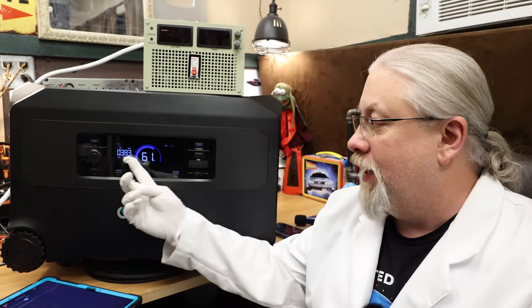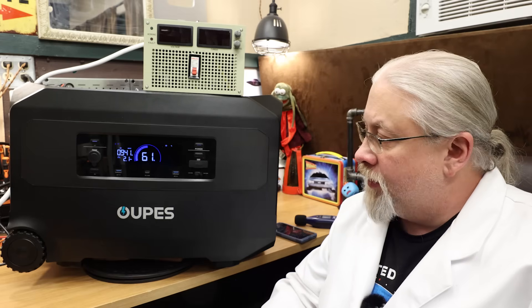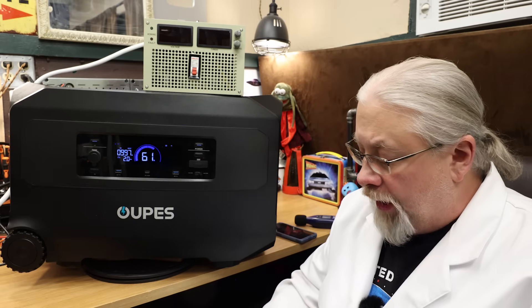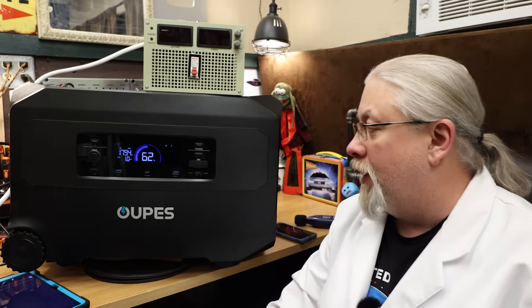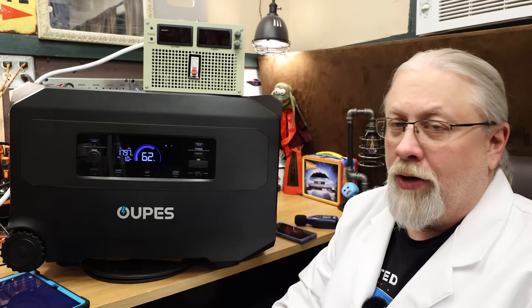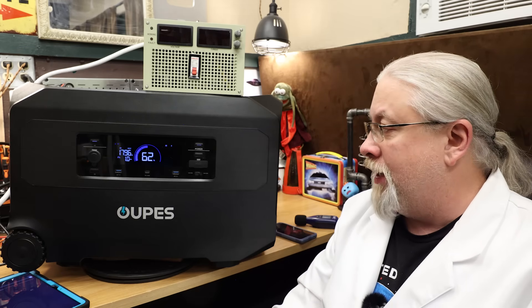Sliding up to 1,000 watts, you have to wait because it takes a very long time to ramp up to the chosen charge speed. Even at 1,000 watts, the fan is turning but so low it can't be recorded on a sound pressure meter. Cranking all the way up to 1,800 watts — the maximum AC charge rate — the fan sped up slightly but hasn't increased dramatically. When AC charging, it's actually not too bad noise-wise.